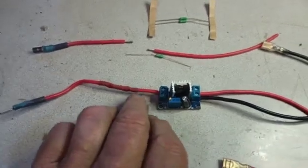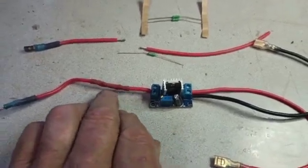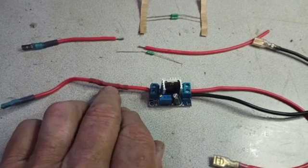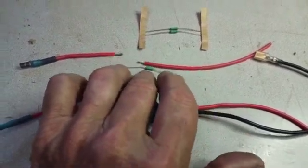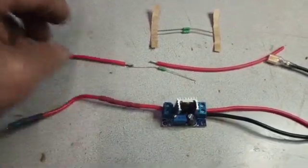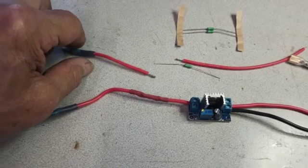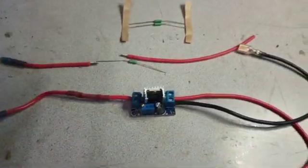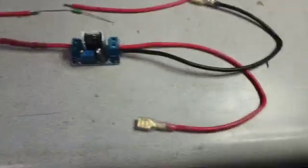On this wire, I put a Pico fuse right here and it's a real small amperage fuse — it looks like that. You can get them at Amazon. It's a half amp. Then you just get the proper connectors, spade lugs, strip it back, solder it together, and you've got it. And so this is the output.